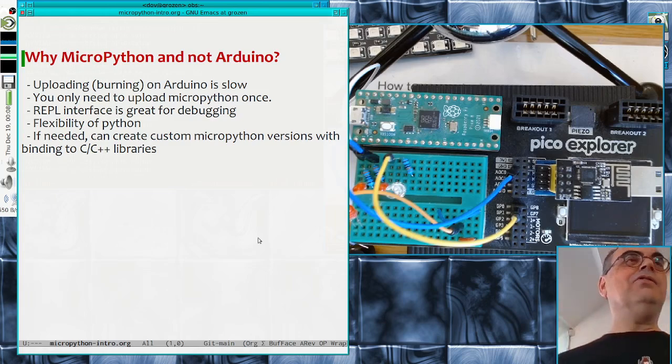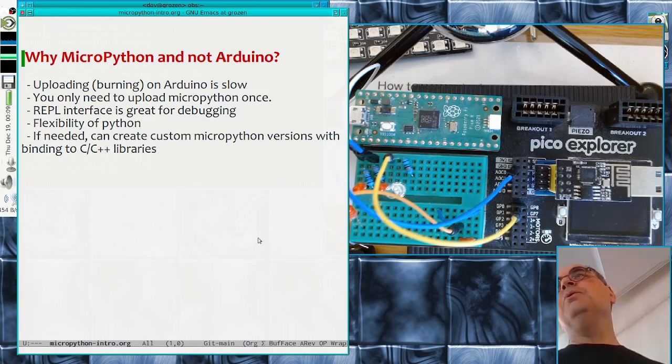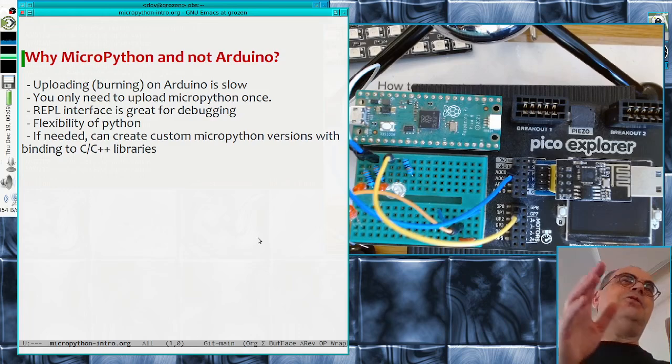Now, the advantage of microcontrollers is that you have a guaranteed time in terms of instructions, whereas on the CPU, you may get interrupts. And Windows, for example, is known for that you cannot get anything on Windows running in terms of real time, which is promised to run more accurately than a few hundred milliseconds.